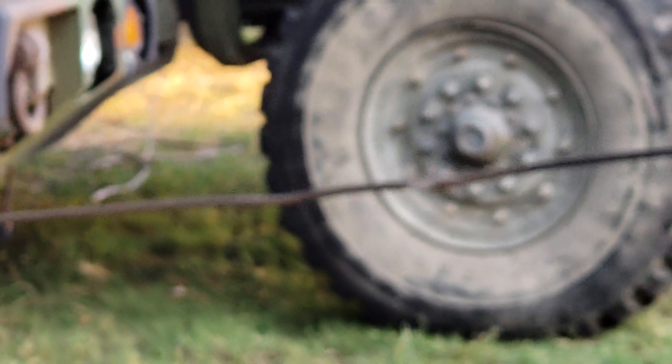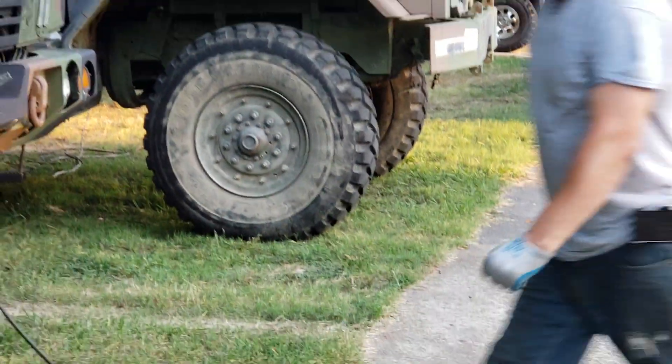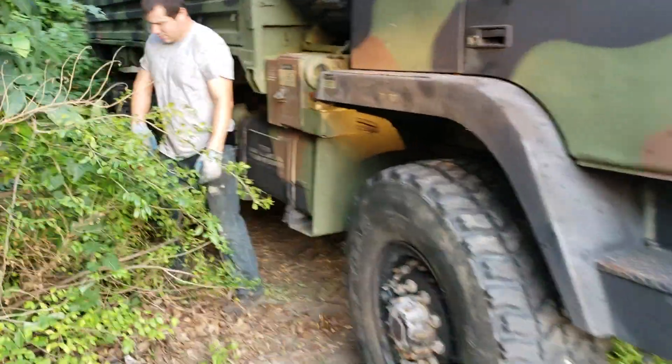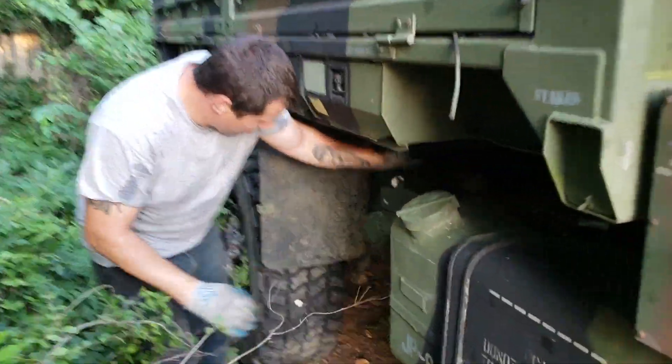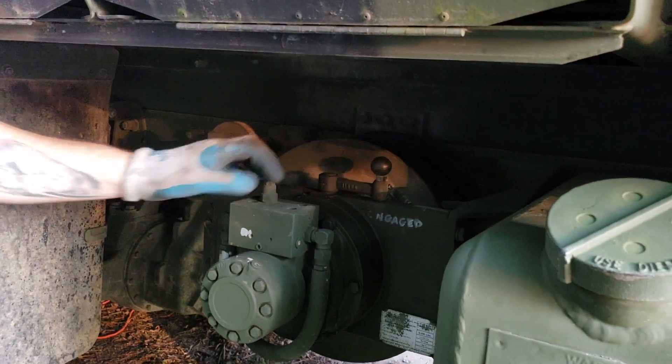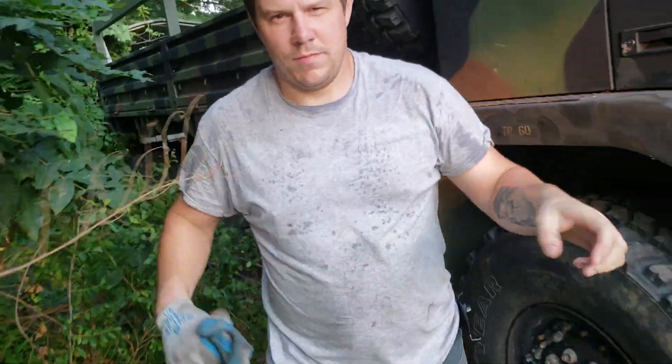You can power it in and out from the dashboard. Back to your winch. Go over to the engaged side. Snap pin down, make sure it's secure. Hold the cable and go ahead.